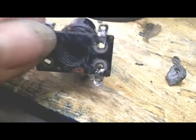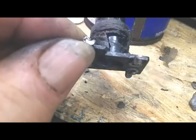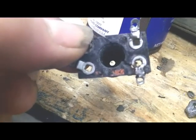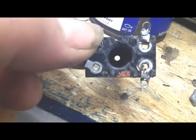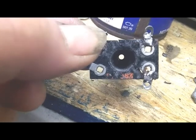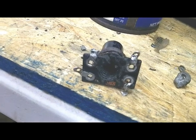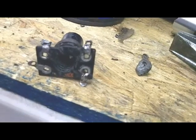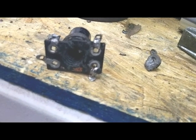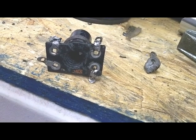I don't think I've damaged the coil in any way, and I think just a little JB Weld around the outside of that, I can repair that. I haven't measured the resistance of the coils yet to make sure they're still okay, but I think they are. They look like everything's okay. So we'll check that. We're going to have to. I actually put a little WD-40 in. I actually got that core to turn about a quarter of a turn, and then it hung up and it wouldn't go either way. We're working with it with a screwdriver,